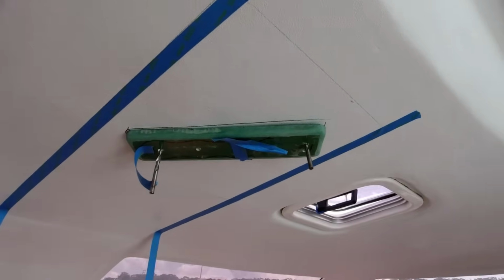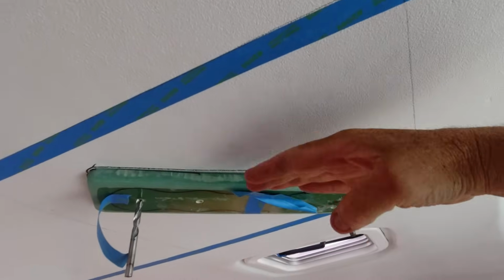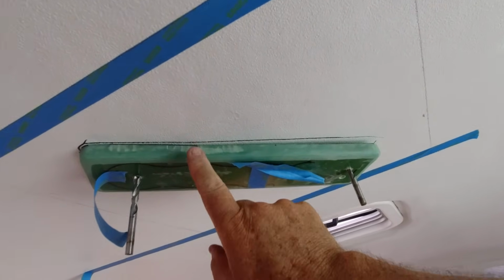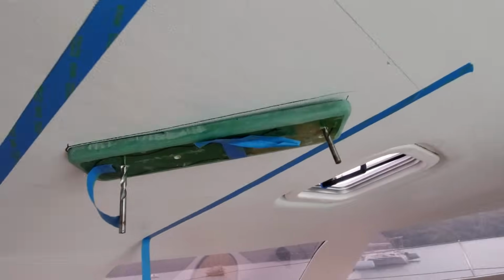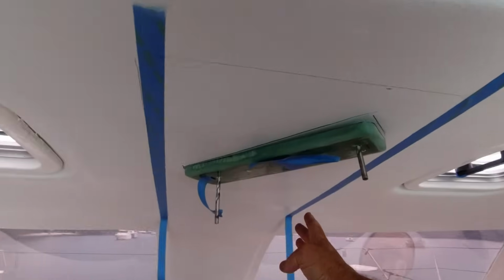Okay, so this is going to be a substantial panel because I need to lay about 7 or 8 layers of glass in there and then have a large block like this, a reinforcer. I may even use this G10 one because it's pretty good. It's going to cop a lot of load because basically all of the lines come straight off the mast and then back across to the helm.